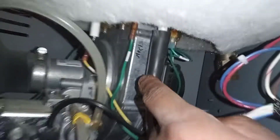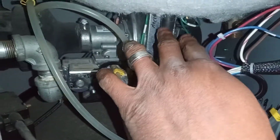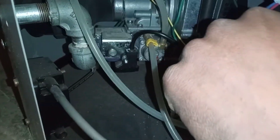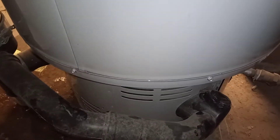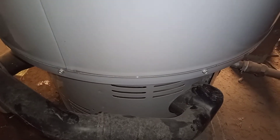Ideally I would have liked to get the bolts out — there are four bolts there — in order to get to the burner and then remove it. But this burner is not like the usual; it's at the bottom rather than the top, so it would be a nightmare to get out as there's not much access. I'm going to print out my combustion readings as well to see if I'm getting good combustion, and leave the printouts on the boiler.